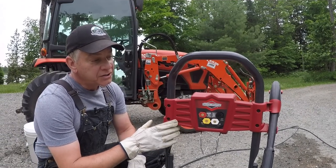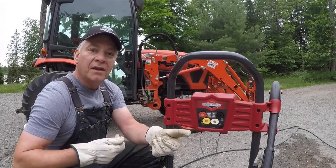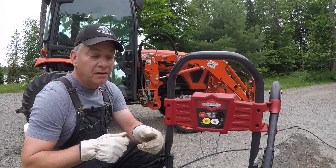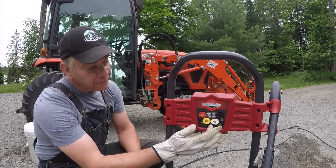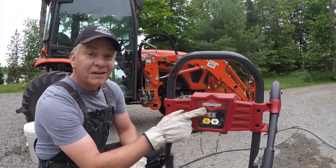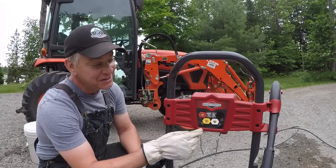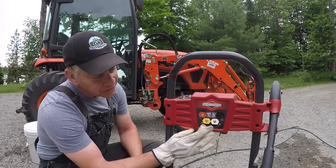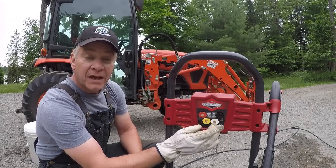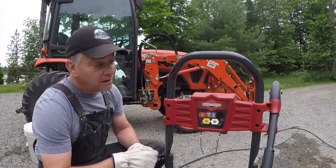The old pressure washer I had basically had a twist or a handle in the middle of the wand that you twisted to adjust pressure. This is really nice. It's got 4 different tips. One for washing with detergent, one that gives you that 3000 PSI that you only want to use in extreme conditions. And then you've got two different degree tips that'll give you a difference in pressure as well as a difference in spray, of course.